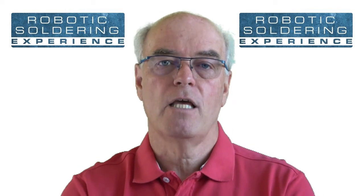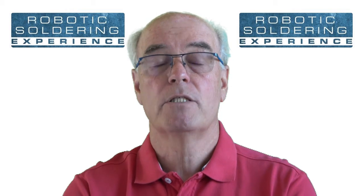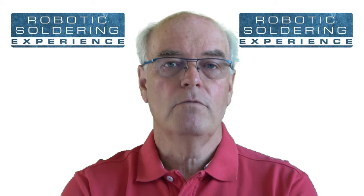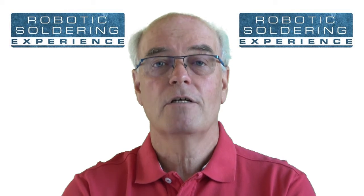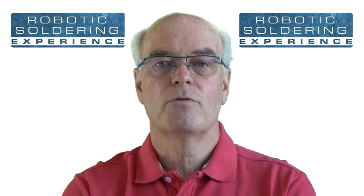Of course, in high volume production, it's possible to preheat the whole of the assembly, just giving a small amount of heat into the whole of the board, which again would overcome thermal demand on a particular printed circuit board. So through-hole fill is important to meet customer requirements, but think about the thermal demand, the soldering temperature, the soldering operation, and the speed at which you need to process your boards.